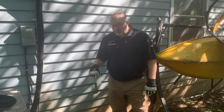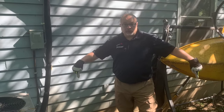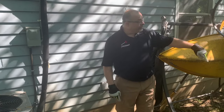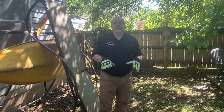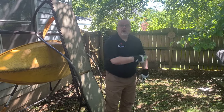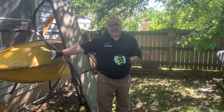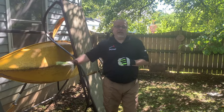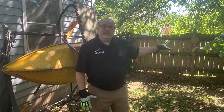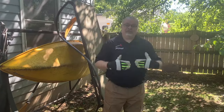This clean out is a vertical pipe that attaches to a horizontal sewer line going out to the street — in this case, going out to an alley in the back of our home. If you know where your sewer line is, you can always find your clean out because it's going to be along that path somewhere. Sometimes it's located 12 to 18 inches away from the building; other times it's out in the easement, like in your front yard area — that little strip of grass near the street.